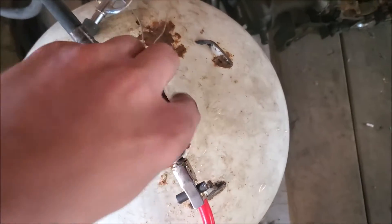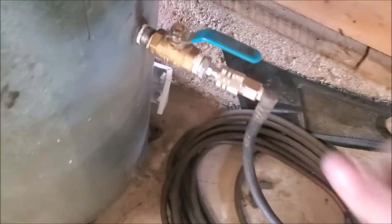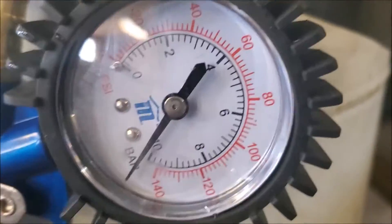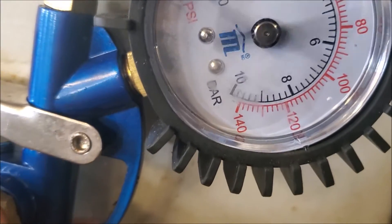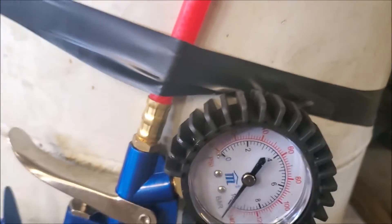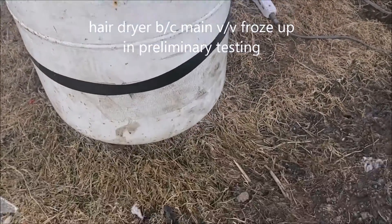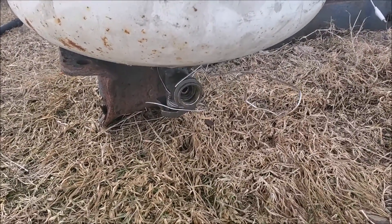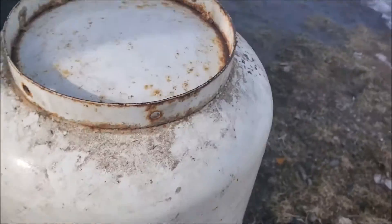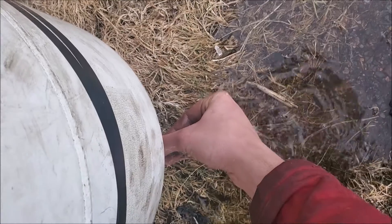What we're going to do is just shut this valve here — shut this valve. It's a little over 10 bar. All right, and we're going to start draining water out of it. I've got my tank upside down to basically allow the air pressure to blow out the water. We're still at 10 bar. It's kind of the slow and boring part, draining out all the water.